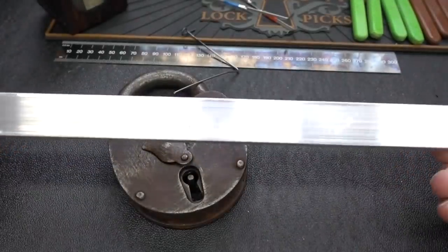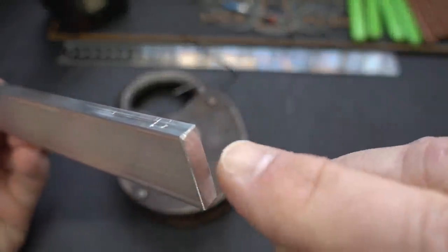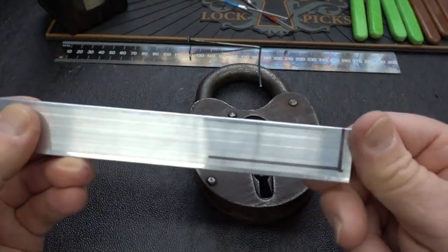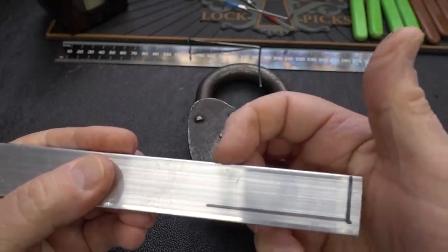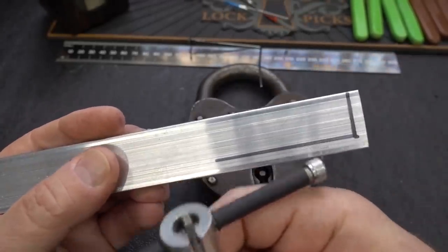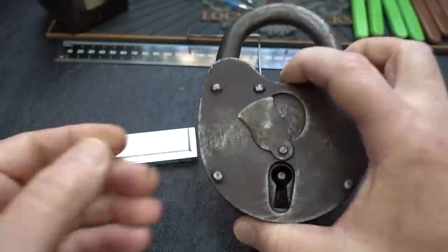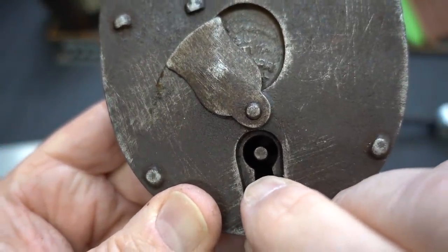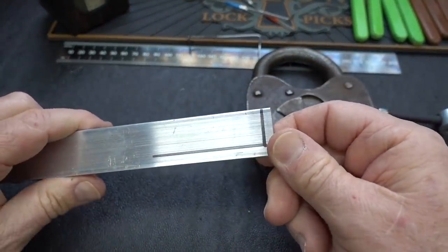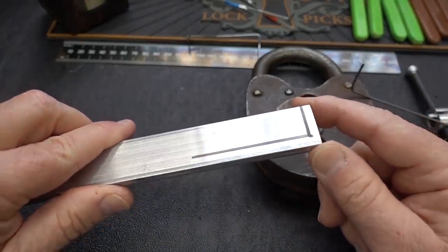On with more magic — now I'm going to escalate things. I have a piece of one inch by one quarter inch aluminum bar here. This is wide enough so I can drill a hole in there that will match the piece of piping on this old Russian lock. Then I'll put it on the milling machine and mill out all that — I'm just going to leave myself the tensioner and something to put inside of my tensioning clamp to slide in there. So we'll have a homemade tensioner. It is just a little bit wide at a quarter inch, so there's a constriction there where it narrows. I'm probably going to have to narrow it just a little bit, but hopefully this aluminum bar will have enough strength that I can twist it and tension this lock. Let me put it on the milling machine and let's see what we can come up with.